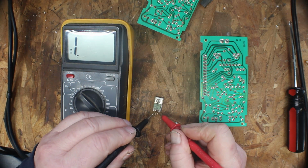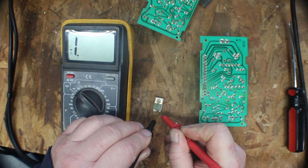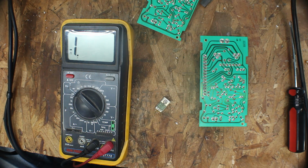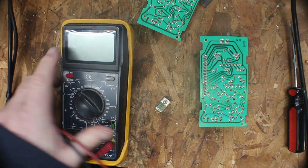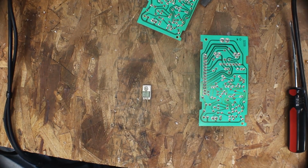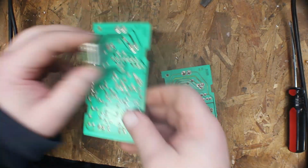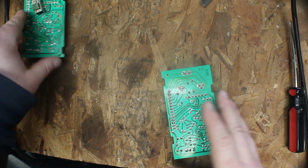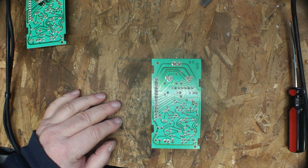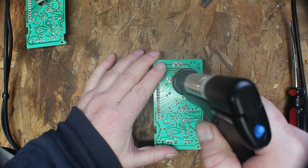It's usually pretty close. I've had some where I've changed them. See, there's your left leg and right leg, nothing. I've changed them out where they were 0.69, 0.68, just because I felt that they were getting weak, so I changed them. So now we'll get out a new one, and in fact what I'm going to do is I'll pull the other green one. We'll keep those together. That's our left side. I'm going to pull the other green one on the right channel and see what we come up with on that one out of the circuit, because they're very simple to pull.